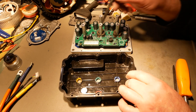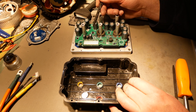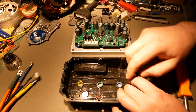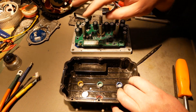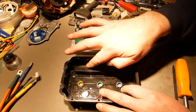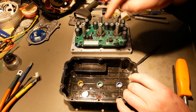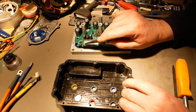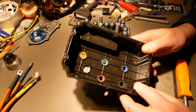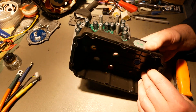There was no silicone here at all down to these pins, so that did not seal up in any way. They were completely dependent on the potting to flow around underneath and seal these holes around those pins — this is just hard plastic with no grommet or silicone seal at the bottom of the pins. It was totally supposed to be the potting doing that, and it didn't. This corner out here was completely not soaked in potting when I pulled it apart. Some attention to detail is not so great in this Far Driver controller.